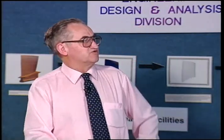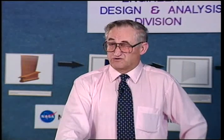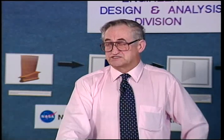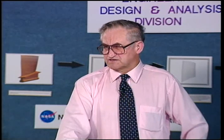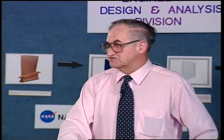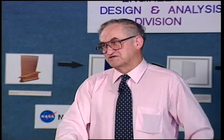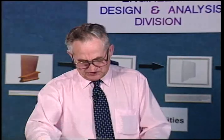When should I use threaded studs with nuts instead of fasteners in tapped holes? The threaded stud works better than a fastener if you're not going to remove it, because you can just let it rust in place. For instance, the manifold on an automotive engine is usually installed with threaded studs, because once it rusts into the manifold it's like a bolt sticking out — your chances of getting a nut off and chasing the threads are much better than trying to twist a rusted threaded part out of a hole. So the threaded stud works better, particularly here in the rust belt.